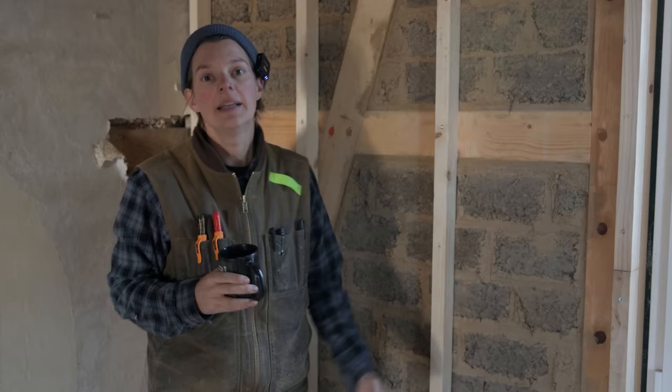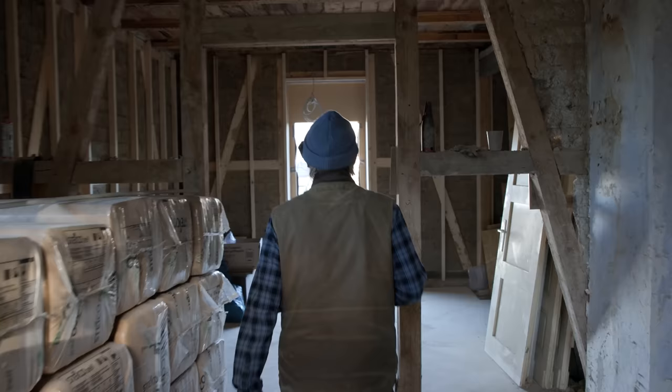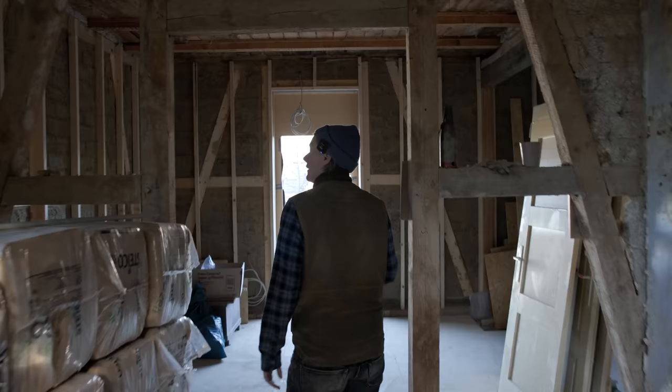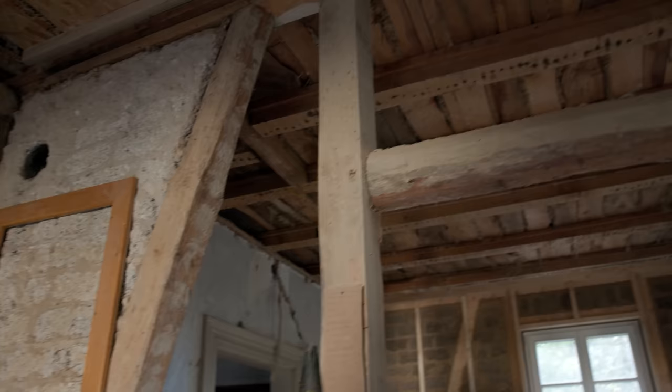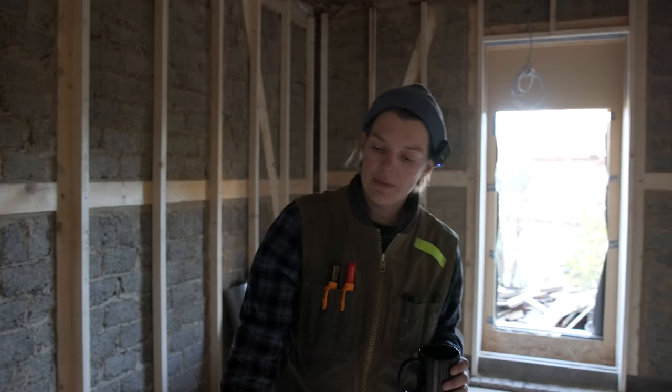But I agree with you that the half timber frame is beautiful, and that's why I want to have it exposed on the inside of the house, which also gives this cool contrast of modern aesthetic and traditional aesthetic. Like we have it here, this exposed timber frame looks beautiful, and I want to have that everywhere in the house. And that leads me to today's confession, because I said it so many times, we're finally done deconstructing. We're not. We have to rip out the walls upstairs so we can have this frame. And before you say anything, remember, the timber frame is responsible for the stability and the fill in the wall is not for stability, that's just for windproofing and insulation. So it is okay to take it out upstairs. But it is a lot of work, so let's get to it.